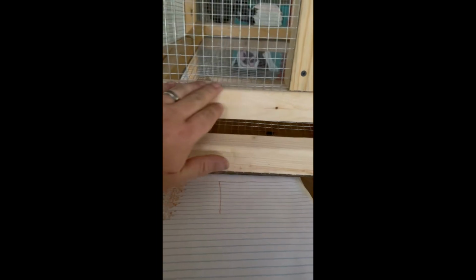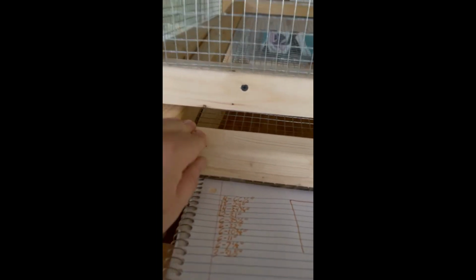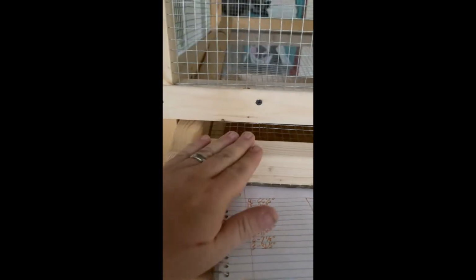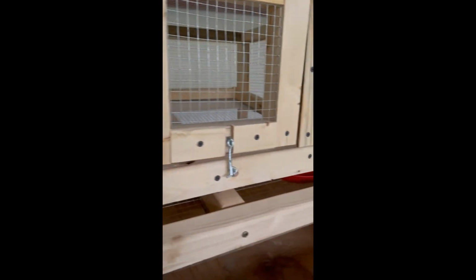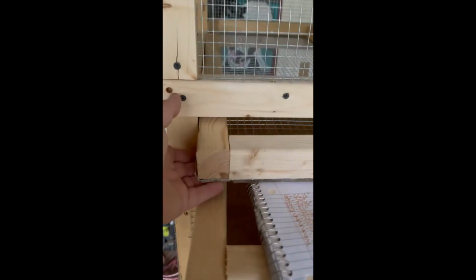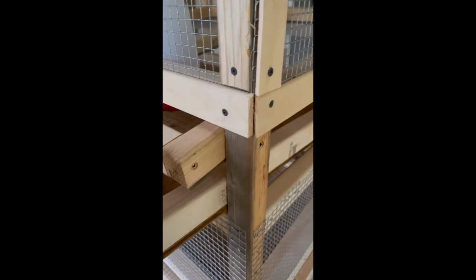Now, once you get everything put together on your square, make your bottoms before you put fence on. Slide your bottoms in. Like I said, put a screw in each corner. If you want the egg rollouts, you pick them up, put them tight against this bottom board, shoot a screw here and a screw here into this rollout.